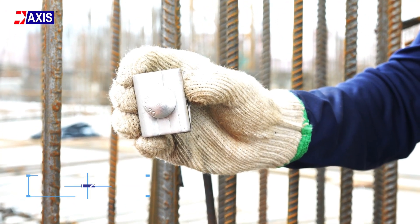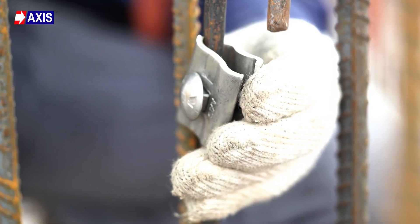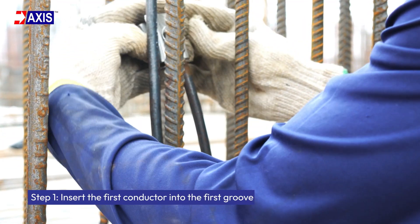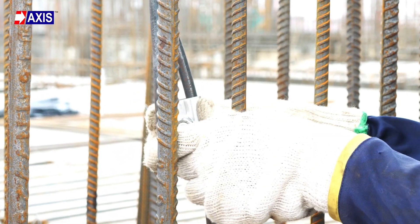Let's look at the installation procedure for the parallel connector. Step 1: Once your conductors are prepared, insert the first conductor into the first groove. Place the first conductor securely into the first groove of the parallel connector body.